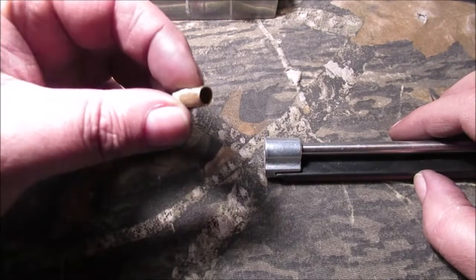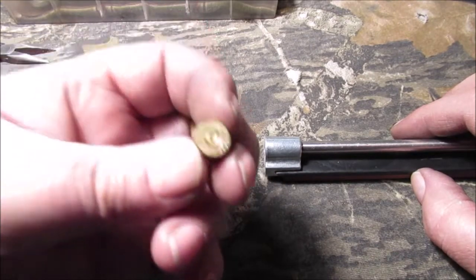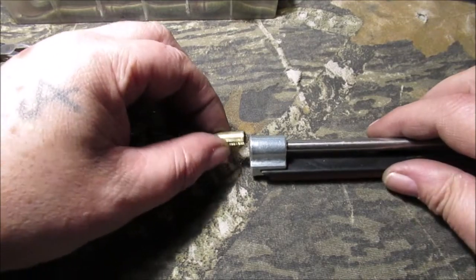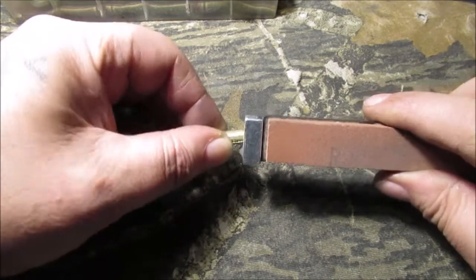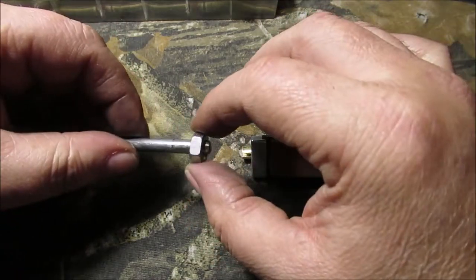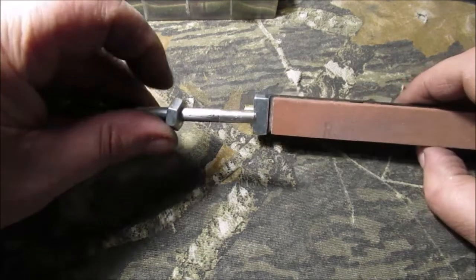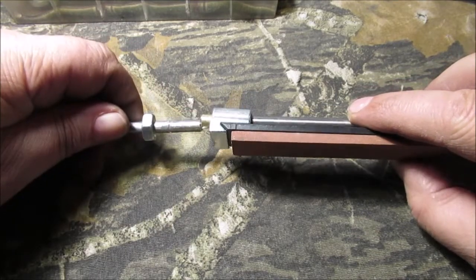This is all I did — this piece is made from a shell casing, a 38 Special. I use these to cut holes in paper gaskets. You could probably get away with taking some aluminum from a pop can and rolling it, but this is already round. I kept squeezing with the vice grips to make it rounder. So all it is, it just fits in here and will be epoxied. This nut — I drilled out the threads. It's just whatever nut was fitting on them — it's a metric nut — and it just goes in here.